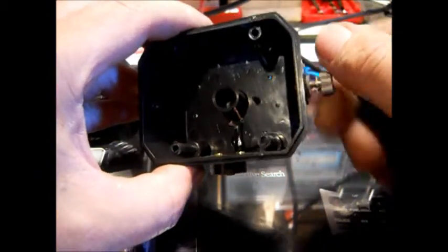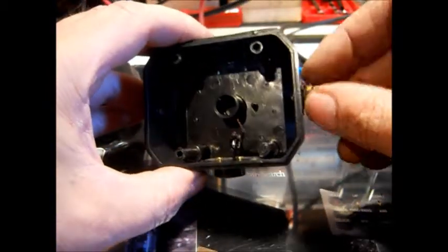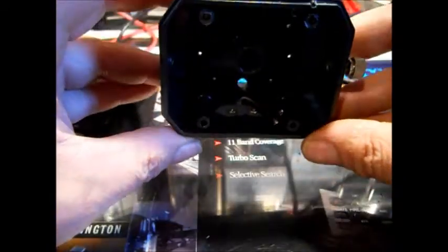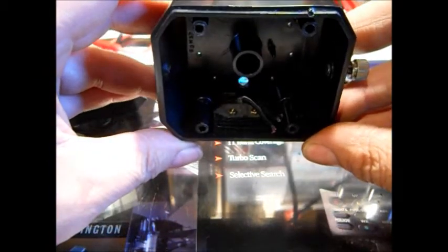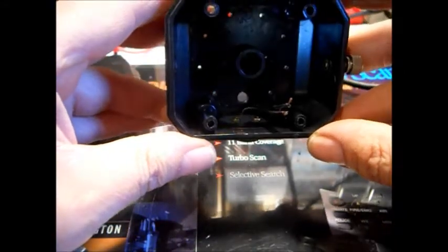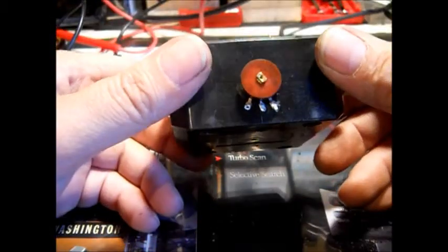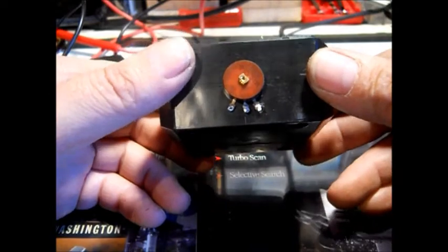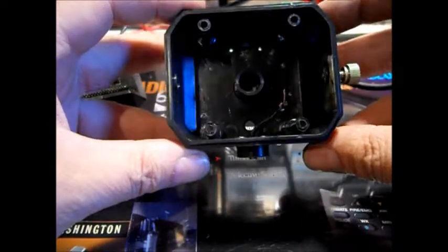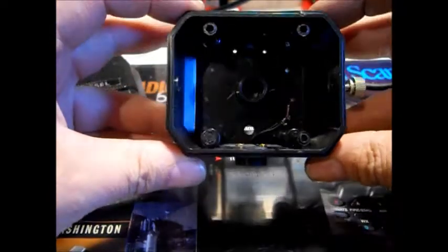If the bracket's long gone, we can bend one on plexiglass, aluminum, anything. It does have some nice little knobs on it. You can kind of see in there where I ground the plastic down so I have more room. I will also put hot glue over those to insulate it — that way they'll never come loose. I cannot tell you what it came out of; it could have been a transistor radio. It is 10K — 10,000 ohm. I like using them on a speaker better than a 5K; I seem to get more control. I've used both over the years.